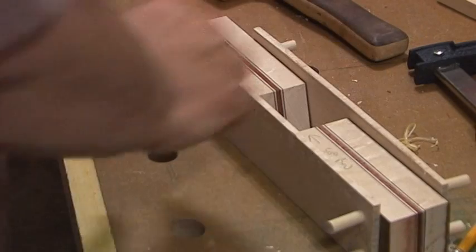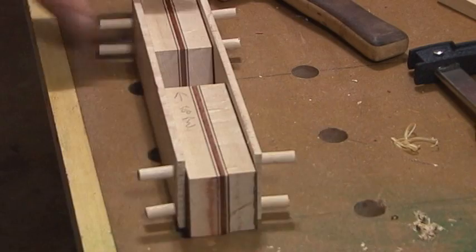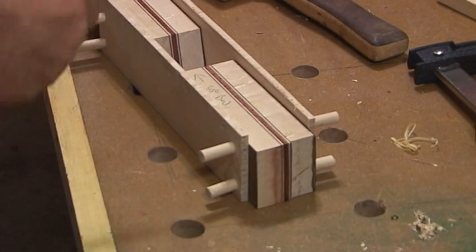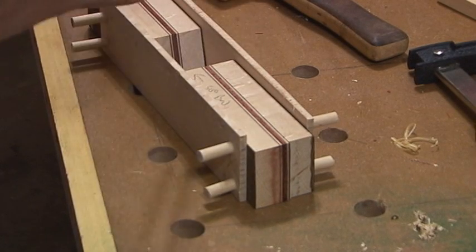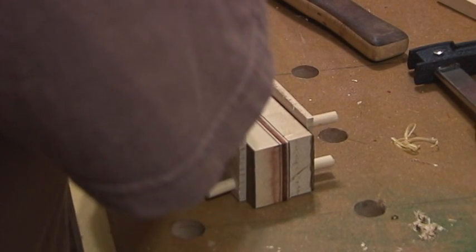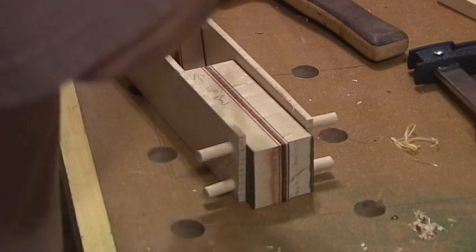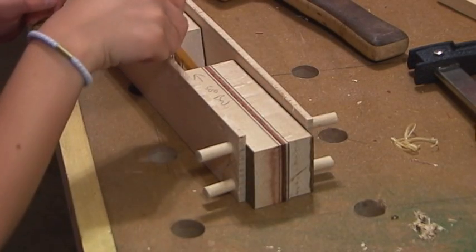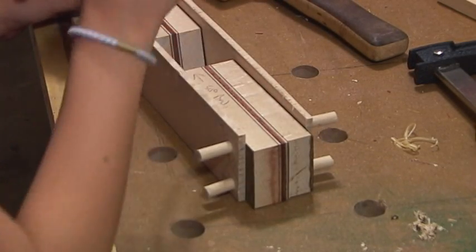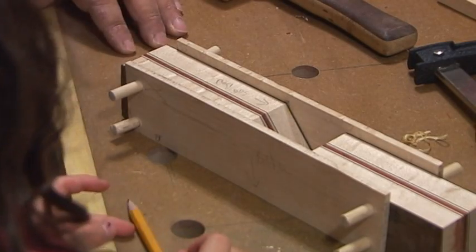So we're going to mark the mouth. What you're going to do is draw on these outside boards, just this much right in the corner — right up we go. Do it a couple of times and draw all four sides. Do the other side. You know why we did that? That's going to tell us where not to put the glue.